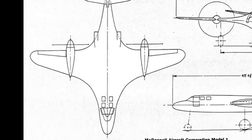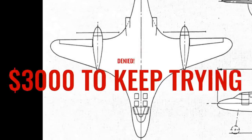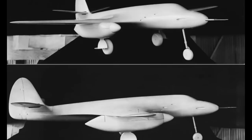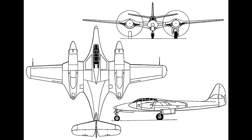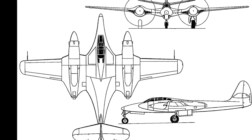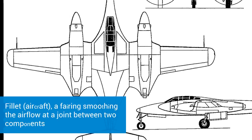But this aircraft scored 21 out of 23 proposals, and only earned a $3,000 check from the Air Corps to keep it going. McDonnell kept at it, coming up with a couple of new proposals that began to be a bit more conventional. They scrapped the pusher propeller idea and decided on using two engines, one in each wing in a nacelle, each driving a four-bladed propeller. Their Model 2A was revealed in April 1941, but the design was still pushing the boundaries, with McDonnell trying to incorporate a laminar airfoil section throughout most of the aircraft, merging the back of the engine nacelles with the wings, and filleting all edges of the fuselage and nacelles into the wings in an effort to reduce drag.